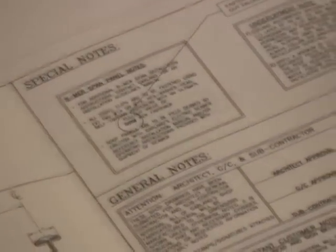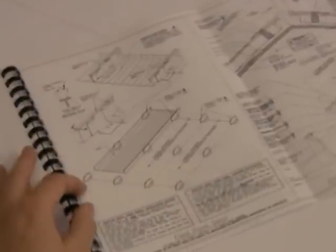Please note that these are specified installation criteria and must be followed to meet wind uplift, water tightness, and warranty requirements. Sheet 2 is the laid out roof plan, clip spacing, estimated substrate length, and detail call-outs. Sheet 3 and subsequent pages contain the project specific details which were called out on the roof plan.